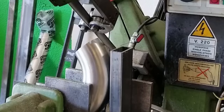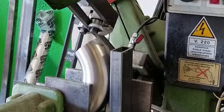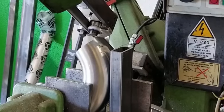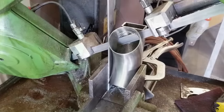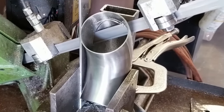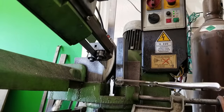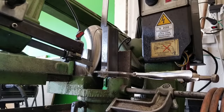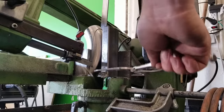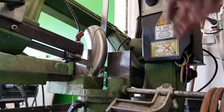The reason we remove so little instead of something like 50 percent is that we don't create a choking point, and we allow enough airflow without turbulence. So it's a general rule of thumb — typically 33 percent or one-third, or somewhere over 30 percent. When slicing these elbows down, take your dear sweet time. Make sure you let the saw do all of the cutting, which will discourage the blade from walking, moving, warping, distorting, or shifting on you.